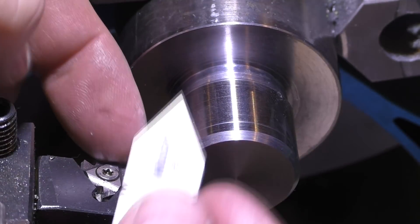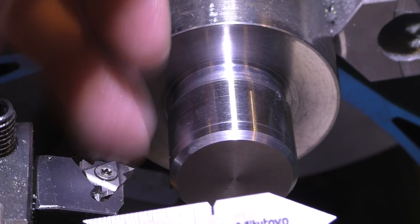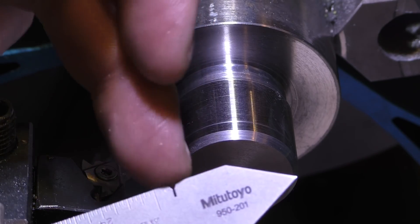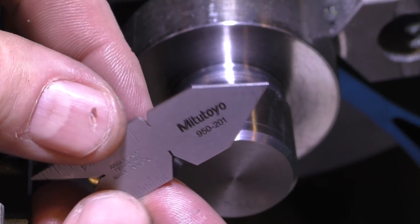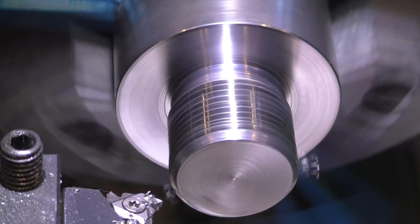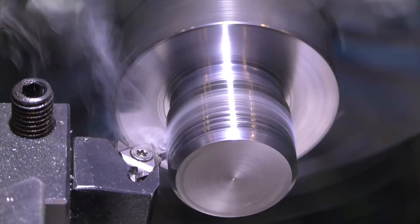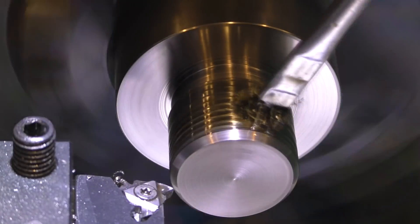We're all set up — the thread gauge is aligned, the square is set, the compound is at 29 and a half degrees. Just in case you were wondering: this thread gauge did not originally work with these lay-down carbide inserts. It would have been fine with high-speed steel or one of the longer pre-done 60-degree carbides, but it would bottom out before reaching the bottom of the gauge. So I popped it in the mill and moved a little material off the top — now it works fine. Threading at another 10 thousandths depth of cut each time, re-zeroing the cross slide and moving the compound in a little bit.